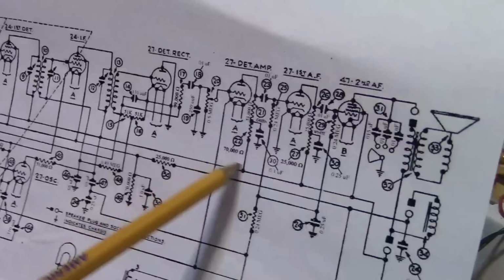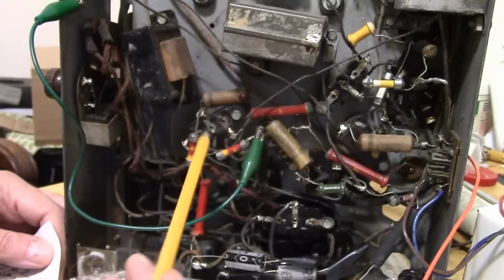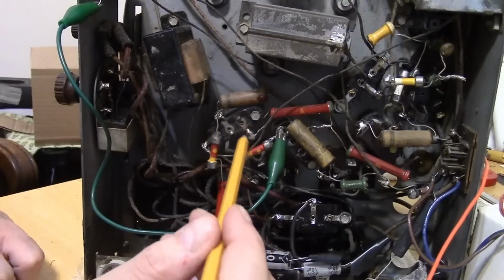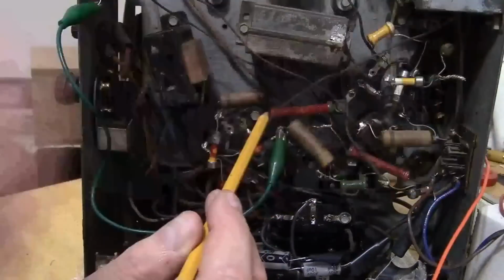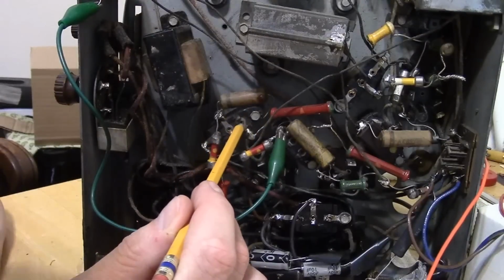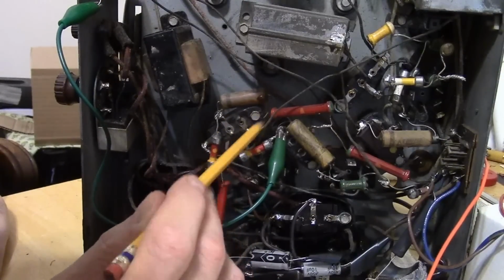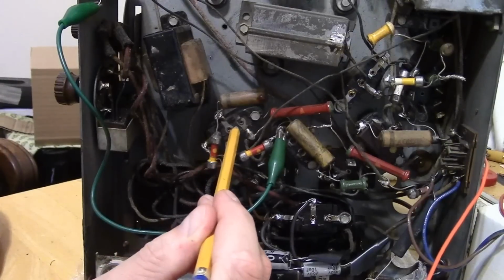Now there are a number of components around here, in this area. And what's going on there? That's where there are old repairs. That's where some funny business is going on. In particular, on this one, that's where there's an external capacitor strapped across an internal capacitor.